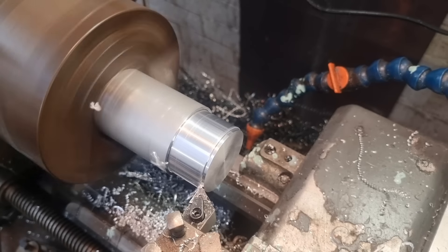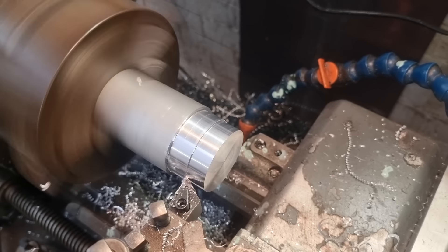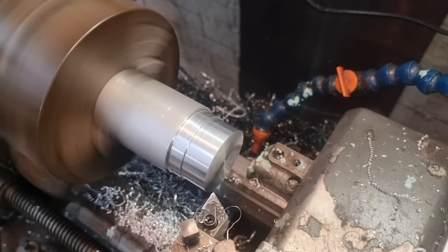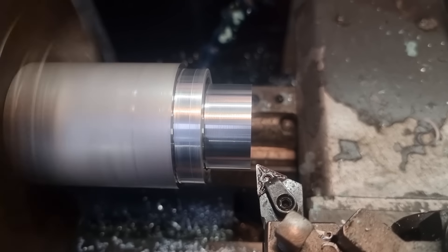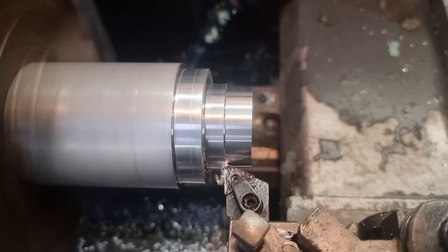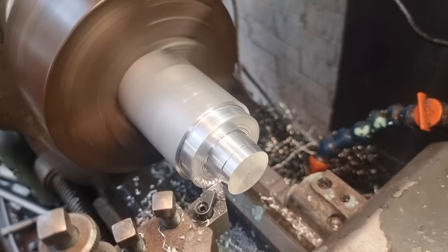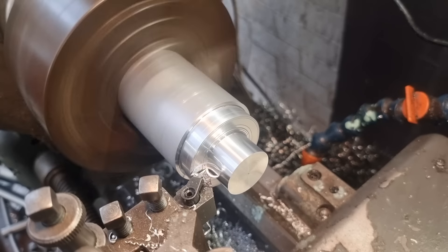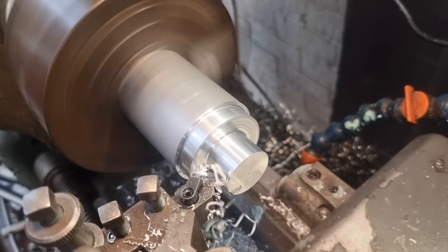Down to a depth of 21mm, I'll keep working up to this shoulder once I've made it, that'll be fine. So we're stepping down to 21mm. 19, 20, 20.9 - there, and then taking that 2mm off. I'll join you near the end. That's a little step just to take it down to size. Staying at 1.7, down to 21mm - 21's there.